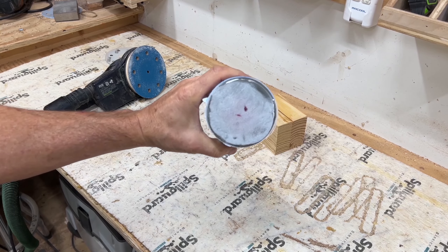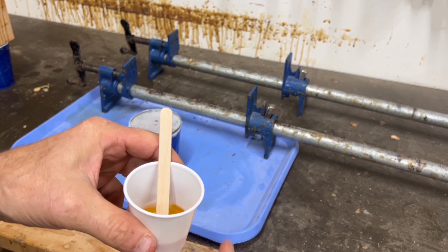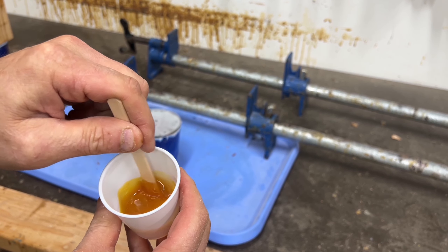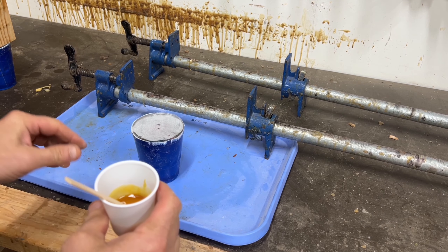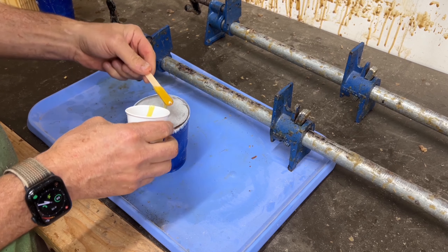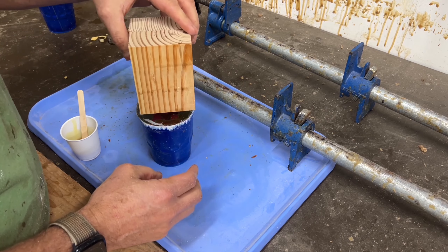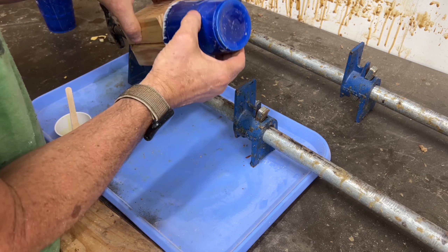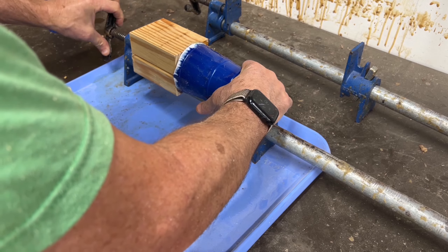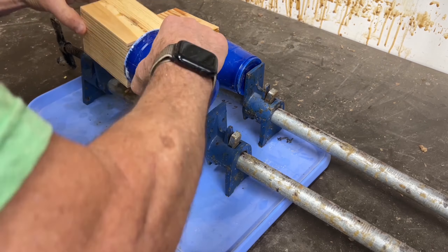Once we finish with that, we'll move on to mounting our wooden sacrificial piece on the opposite end. The ball turning jig I'll be using requires a couple of inches of sacrificial wood on the lathe-mounted side of the project. I took about 40-grit sandpaper and really scratched up that flat resin layer to increase adhesion between the cured resin and the sacrificial piece of wood. Then I mixed up some resin, glued those two blanks up, and let that cure again overnight before moving on to the next steps.